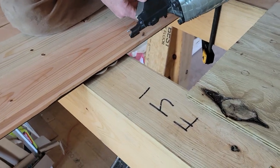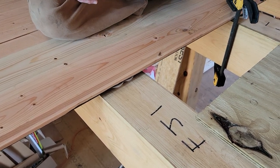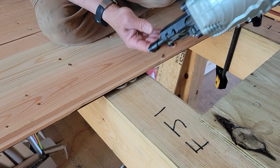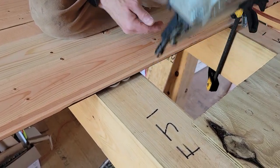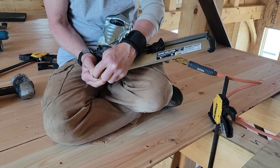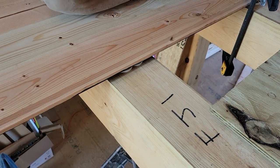Not only do I have it set on full drive — every time you set this gun and pull the trigger you have to be very precise. I'm taking the nozzle of the gun and putting it right at 45 degrees, right into the corner of the tongue. I watch it touch, hold it down, and drive that nail in.